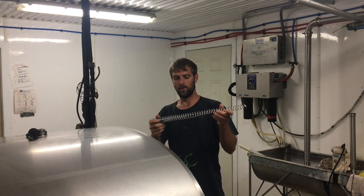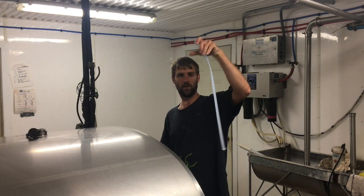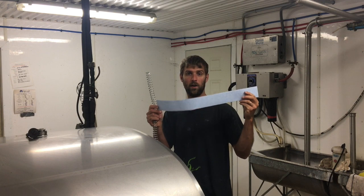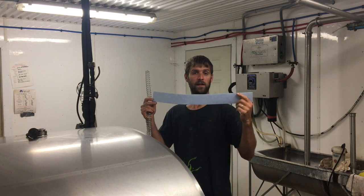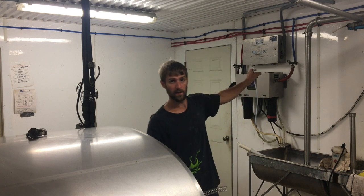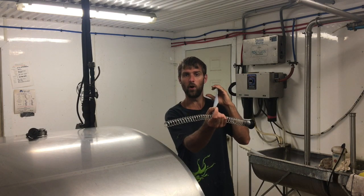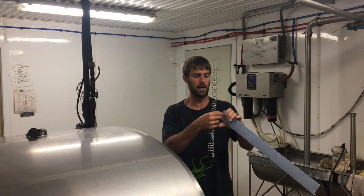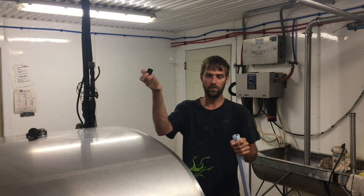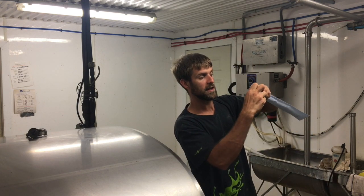The spring is meant to hold the filter open. I'm gonna go grab the filter and I'll show you. This is our filter. This is how it comes, all regulated. Everything is up to spec. We buy this straight from our milking supply company that we get all of our soaps and stuff from, and filters, as you see. Anything that breaks, the piping, anything, it all gets fixed from the same company because they know what they're doing. So the one end is sewn right shut. I can't open that end. This end, I can open it up. Stick the spring inside. Take this black thing off. I gotta fold the filter inside a little bit so that it doesn't move.